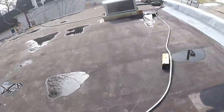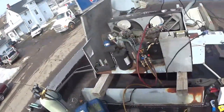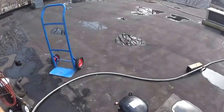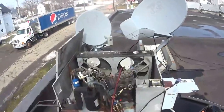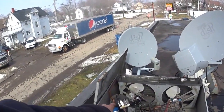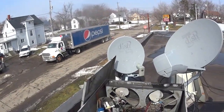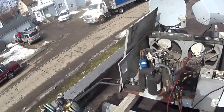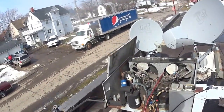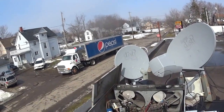Nitrogen tank. What I got to do is take this compressor out, cut the lines, put this compressor in, and then repipe it. I have to hook up the pressure control and the fan switch. I'm going to change that because it's an old one. But we got another 5 or 10 minutes before this is all pumped out of there. Got to get the gas out of the evaporator coils. It's glass door cases downstairs. Got to get all the gas out of that and out of this system here.